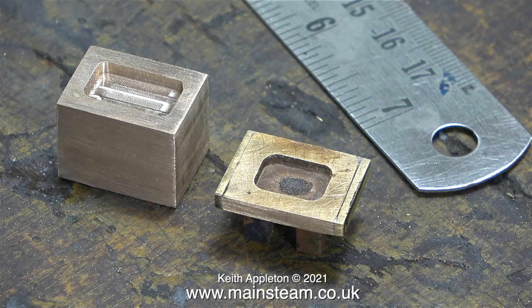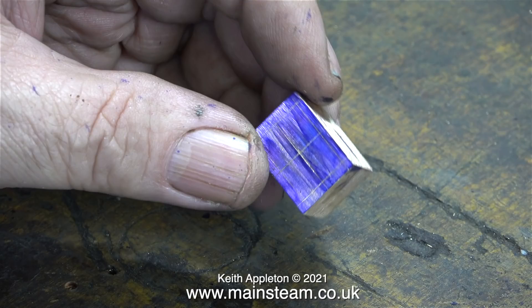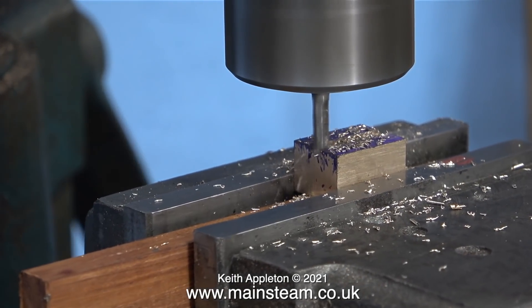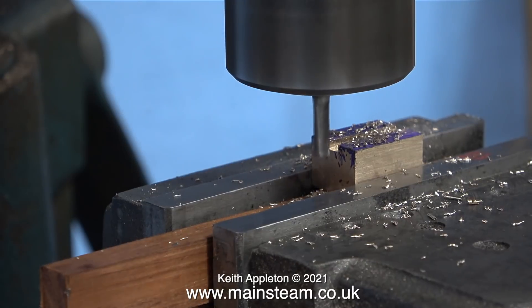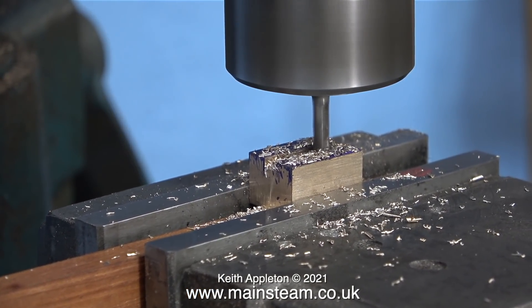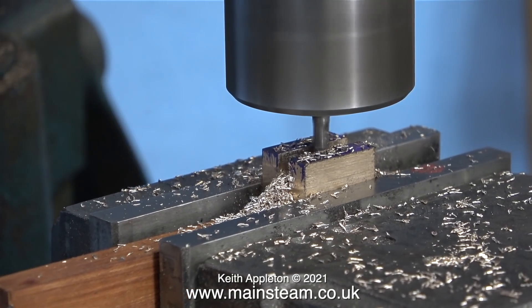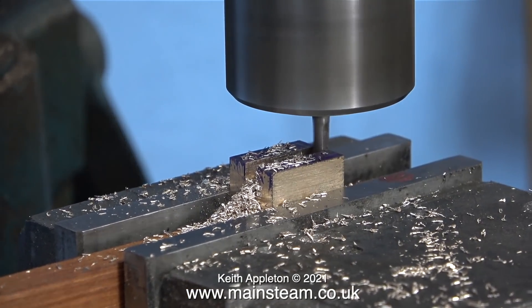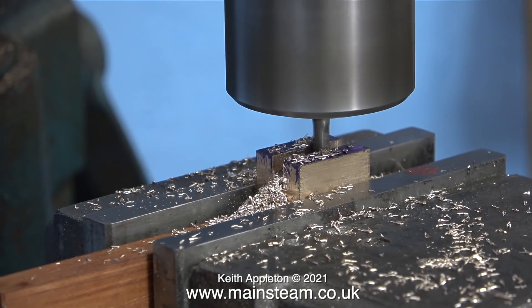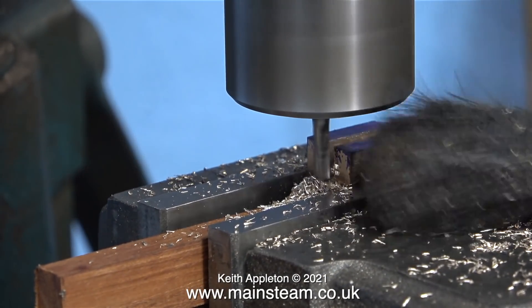On the one I've just made the cutout is the correct size — it was wrong on the previous one. After a bit more marking out, it's time to mill the other side of the slide valve. For this job I need the table to travel full length so I undid the two allen cap head bolts that hold the blocks in place underneath the table. This is the cutter I didn't previously have — it's 5/32 of an inch in diameter, brand new, very sharp, and in no time at all the first slot has been cut.